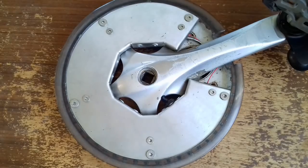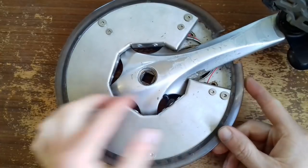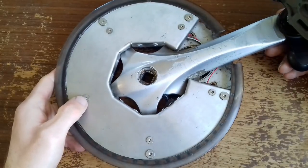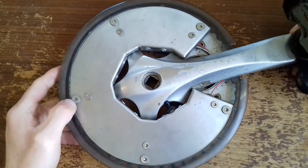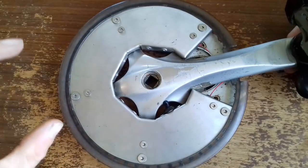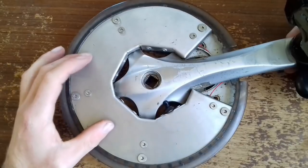So first let's go over the external parts of the power meter that you can see. This is the on/off switch here. It has an on/off switch because this version isn't really that energy efficient — it uses around about 37 milliamps when it's running. It gives a good few hours run time, but that's because it's got two phone batteries powering it, as you'll see later.